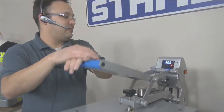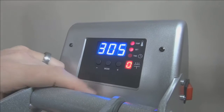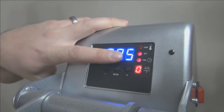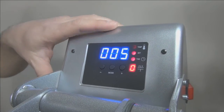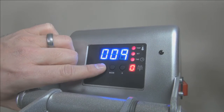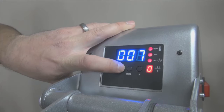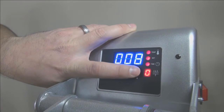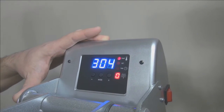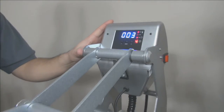As with the Maxx, we have a digital timer and temperature readout. You change the temperature the same way — click the mode button, plus or minus for your temperature. With this one, you also have two timer settings. You have your first hit — if you're doing a pre-press you can set that for four to five seconds — then time number two, which you set to the full application time, 10 to 15 seconds, whatever it may be. So the pre-press will lock down for five seconds, then once you open and press again it counts down for the full time. So you can set your pre-press and your full dwell time separately — a nice feature.